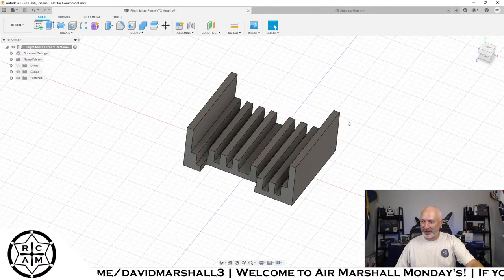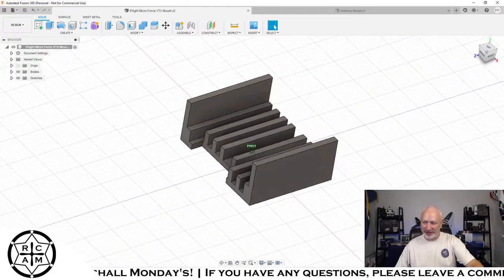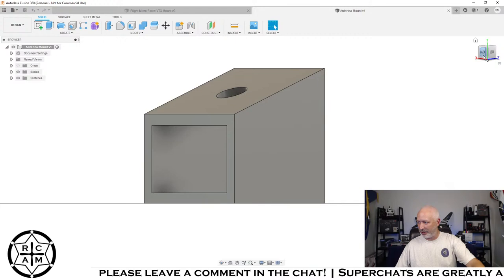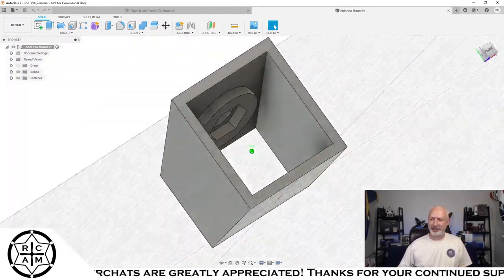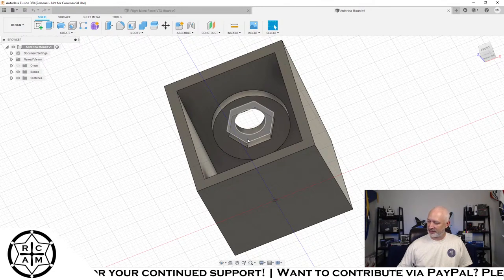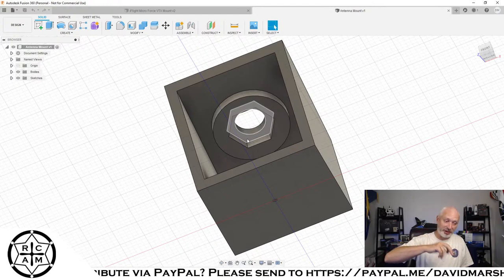Anyway, guys, thank you all for showing up for the first hour of this, going on my little journey while I was designing these parts. I've got this little mount for my VTX that's going in my P47. I made it to add some louvers under there for wind and heat dissipation. And also this little mount for the antenna that my SMA connector is going to go into. Although it looks basic, and it is, on this side it's got a recessed hex area where the UFL to SMA adapter will slide up in there, and you can kind of torque it down a little bit.